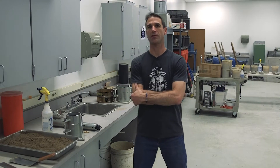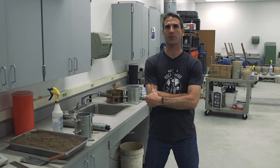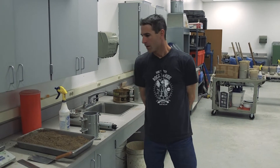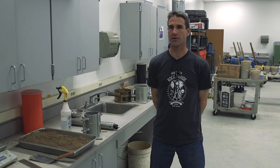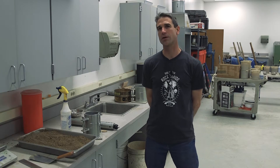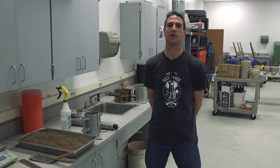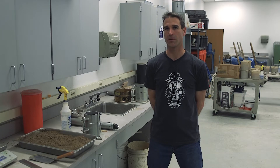This station is going to be T-99 or T-180: pounding a Proctor and getting a maximum dry density and optimal moisture content from a soil sample. When you come in to certify, you'll be expected to pound out one single point for a Proctor curve. This will allow you to complete the T-99 or T-180 practical, and also a portion of the T-272 practical. The second portion of T-272 — how to plot that one point against a single reference curve or a family of curves — will be shown on a separate presentation.